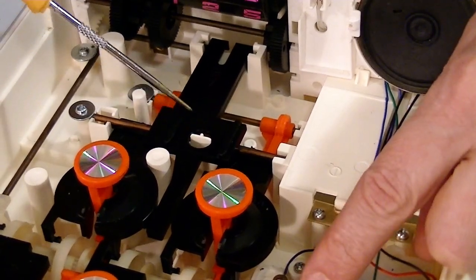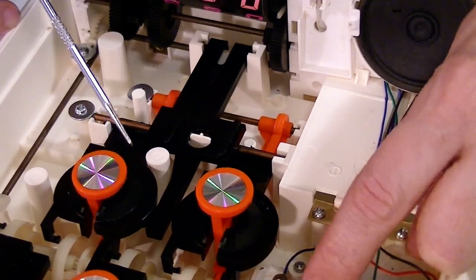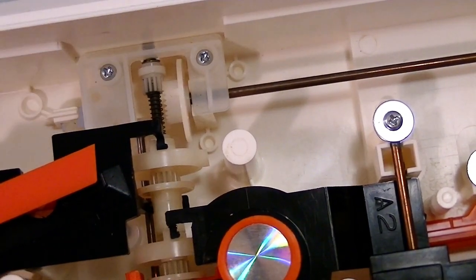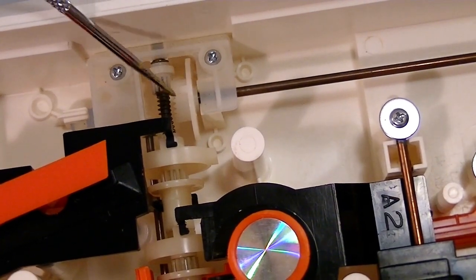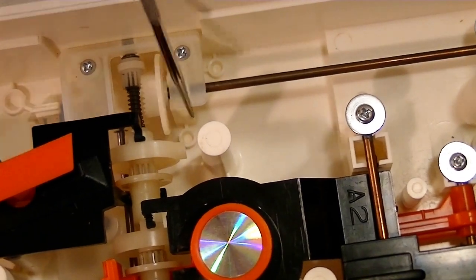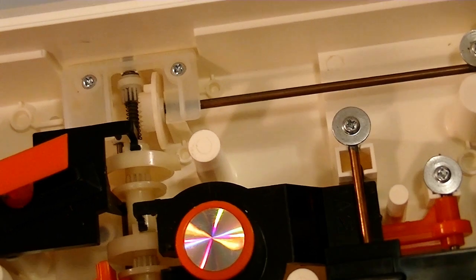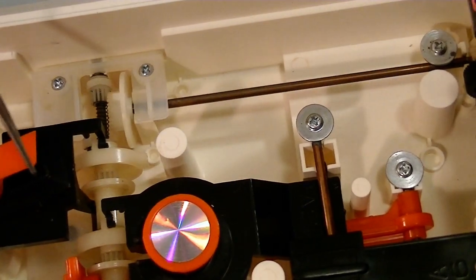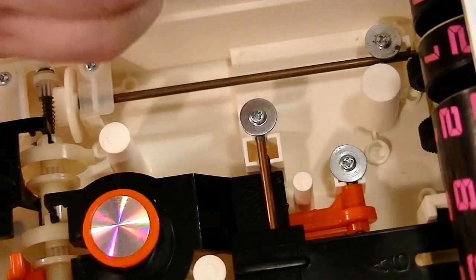These top slotted bumpers just push down this one. So going through the slot is the same as hitting this one here. Meanwhile, that shaft is trying to turn this gear right here, but it's spring loaded, so it wants to, but right now it's not being allowed to because of this gear right here. This gear as well has another wedge that's being stopped again on that flap down below. If I push that flap down and turn, you can see it now allows it to turn. So every time that flap gets pushed down, it allows this gear to spin that is connected to the shaft that goes to the scoring.